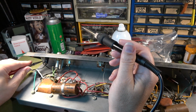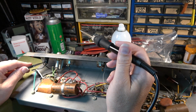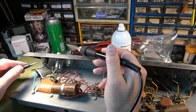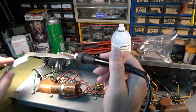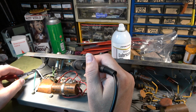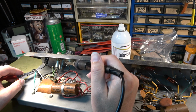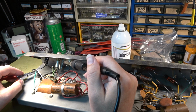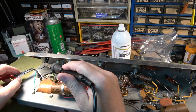Now you do have a fuse that should in such situations blow, but if somebody's put a huge fuse in there, then it might not blow and it would take out the transformer. So you want to be able to switch the thing off, ideally. But also, if there's a short in the power switch, which could possibly happen because it's a mechanical power switch, there are things inside of a power switch that could fail. And if you have the power switch before your fuse, the fuse isn't going to do you any good.